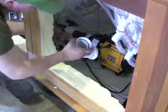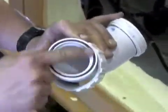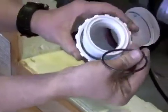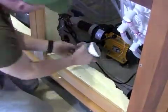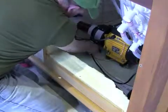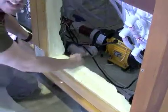Next, this is a two-inch union that goes on to the pressure side of the pump and it just has a regular O-ring that sits in that groove. We'll remove the O-ring — that's what it looks like. Set the O-ring in, or if you have a damaged one, place a new O-ring in. There we go, snugged up. It's made simple enough.